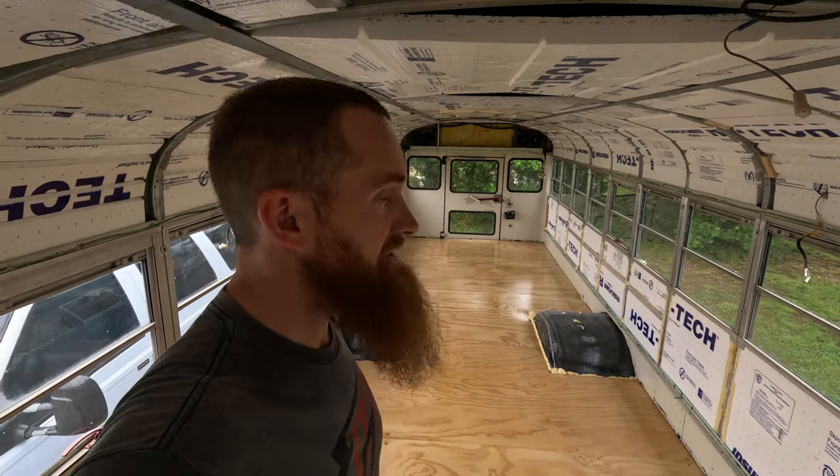What do you think of the floor? Let me know in the comments how you think it turned out. It's been a long road to get to this point, but it's well worth it. We ended up putting four coats down total — two coats from the first gallon can, and since it was over 12 hours before we applied more coats, we lightly sanded the whole thing and used a tack cloth and dust mop to clean everything up, then applied two more coats. It sat for three days and this is the result. The next step is starting to build stuff — probably putting wall pieces in, couches, and moving on from there. If you liked this video, make sure you give it a thumbs up. And if you're not already subscribed, consider subscribing so you can follow along as we convert this school bus into an RV. Until next time!